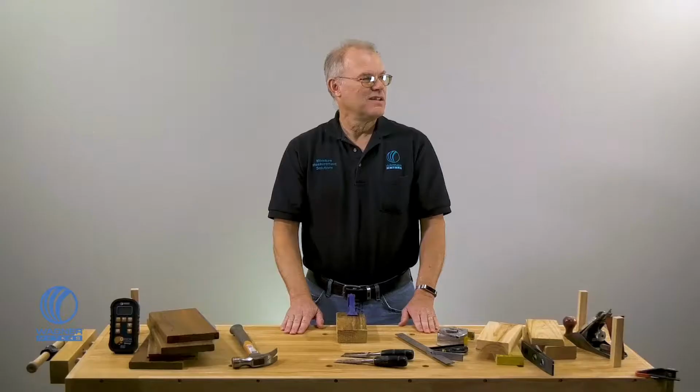These different wood species have different specific gravities, which must be programmed into the wood moisture meter. Make sure to measure each species of wood you are using in your woodworking project to verify that they are the correct moisture content before you manufacture it into your end product.